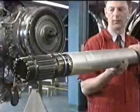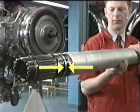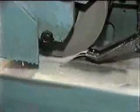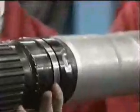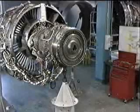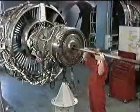The spacer fits on the front of its LP turbine shaft and ensures that the LP turbine rotor setting clearance is correct. The ring is supplied in one size and has to be machined to the dimension calculated and then fitted to the shaft after the module has been removed from the stand. With the checks completed, the replacement procedure can commence. Having removed the measuring equipment, it will now be necessary to refit the guide bar.